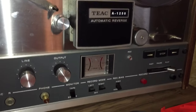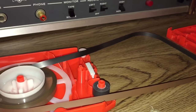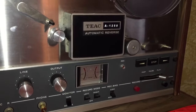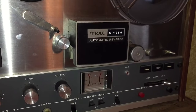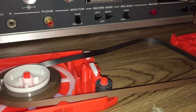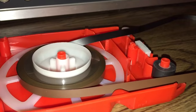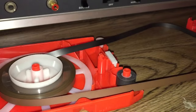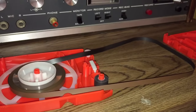So what it did is it gave me the audio program on the left channel, and it gave me the tones that it generates on the right channel. I was then able to connect the right channel of my reel-to-reel deck up to a sampling keyboard and record the tones. There are 2 tones on the tape. One of the tones is a high-pitched tone, and that actually advances the slides for you. The second tone tells the equipment to turn off or pause and wait for you to start it up again. So it actually pauses the playback of the tape.